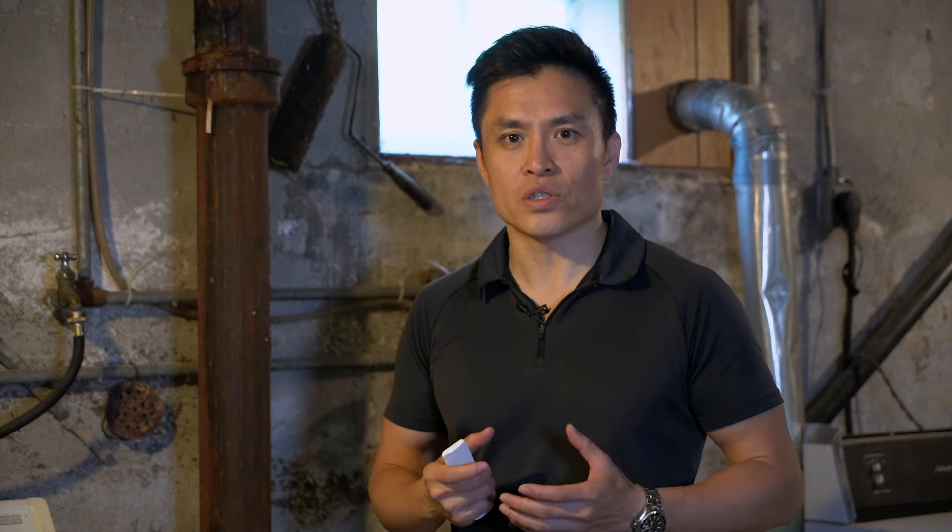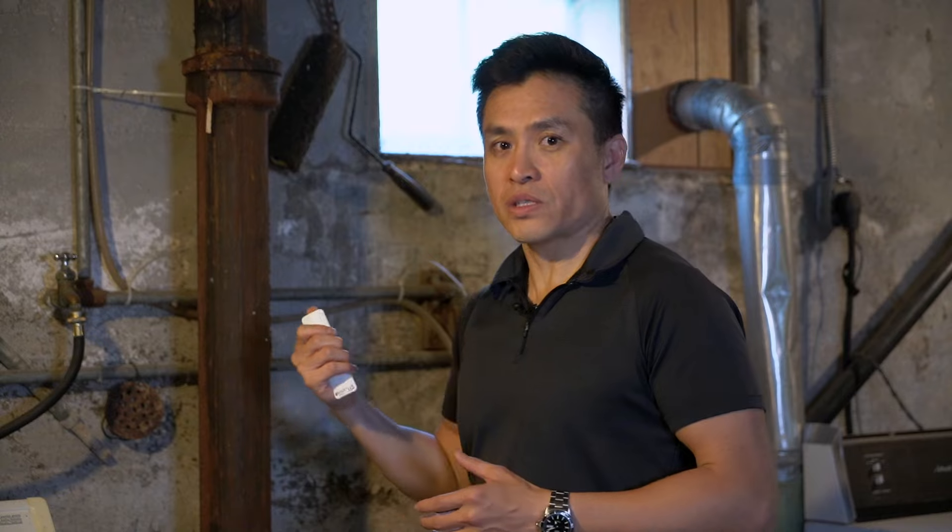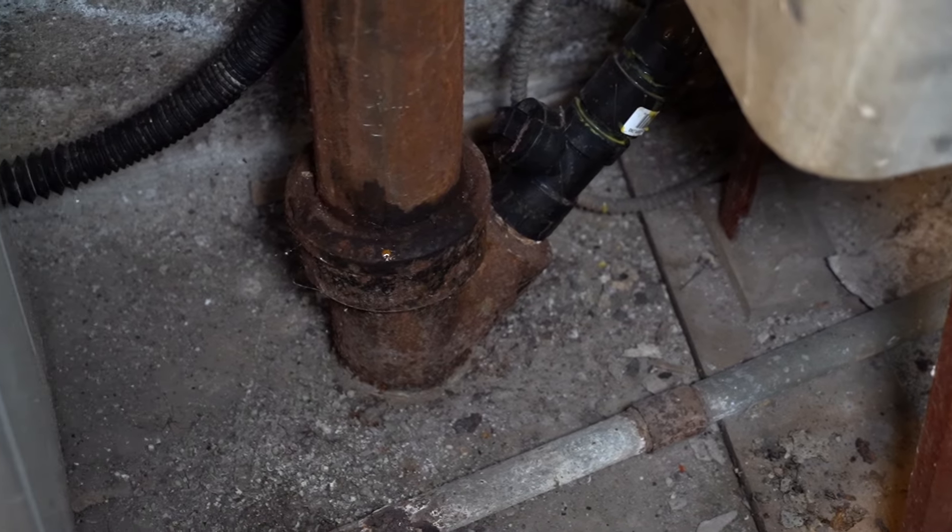So what is this we're looking at? This is called a drain stack. There's a thin one, usually 1.5 or 2 inches thick, that is only used for waste water. This one here is a soil stack — it's 4 inches thick and it's used for the chunkier stuff.